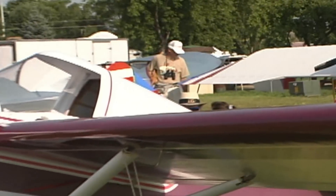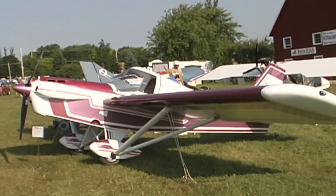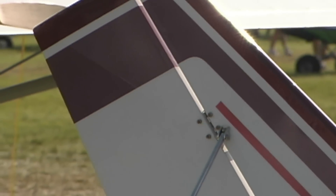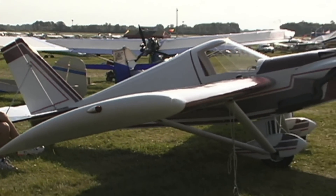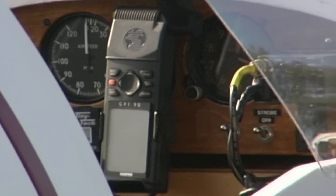What's the difference between the Minimax and the Eros? All of the Team mid-wing airplanes are Minimaxes. They have the 103, then they have the Z-Max, the V-Max, and this is the one they call the Eros. The first difference I noticed is that this is not powered by a little 277 — it's a 503 Rotax. It cruises around 70 miles an hour, gets off the ground in about 150 feet. I built it for my own personal cruise airplane, and I put strut fairings on it. That picked me up about an extra five miles an hour cruise speed. It's just a joy to fly.